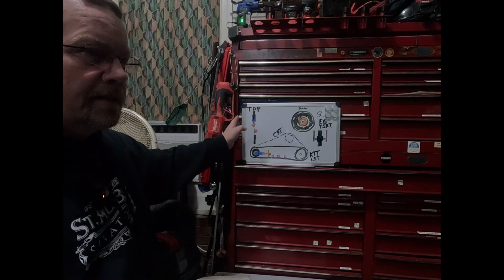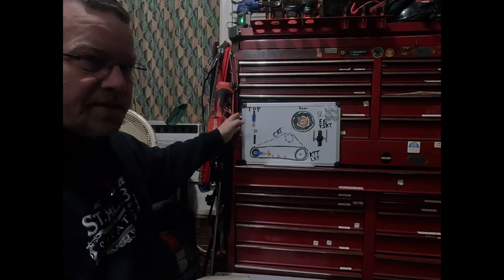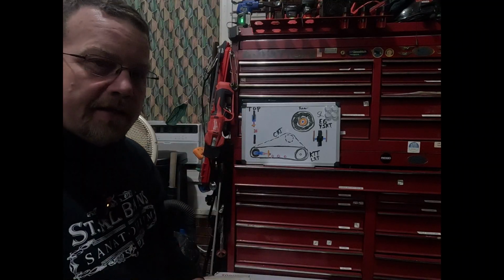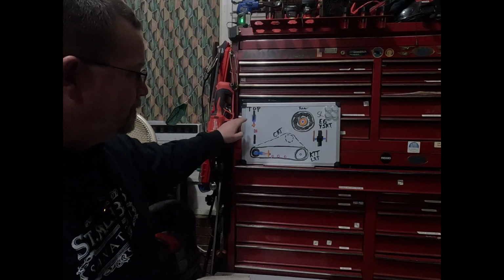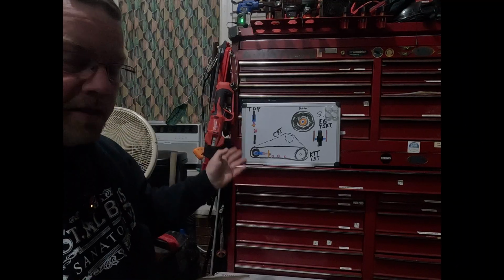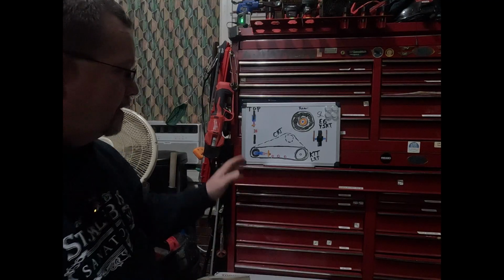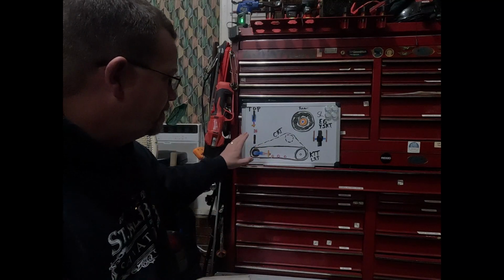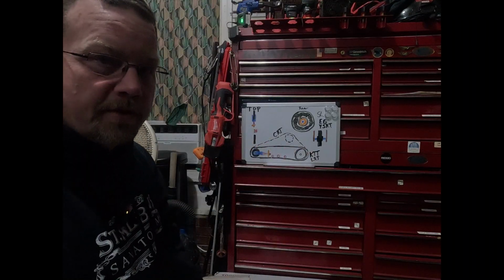It can have a little bit, and when I say a little bit, maybe no more than an eighth to a 16th to an eighth of an inch off. You want it as true as possible. That's also where you need to really check that frame. Some people are having frame warpage issues where the frames used to be straight, now they're kind of canted and twisted. You might have to pull it off, re-straighten it. That's another thing that a lot of people are having issues with. And then, like I said, just basically do a good check over just to make sure before you go ahead and start putting the track on.